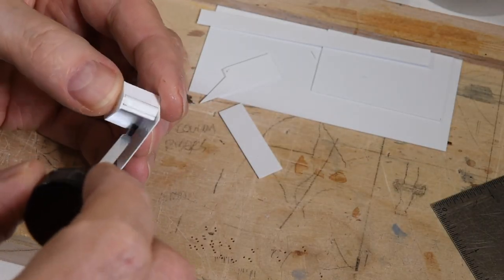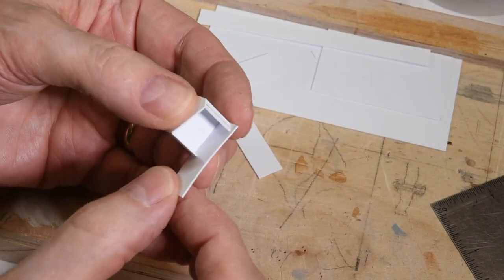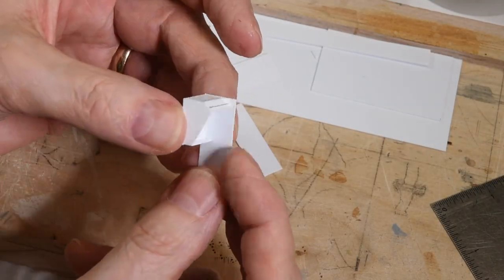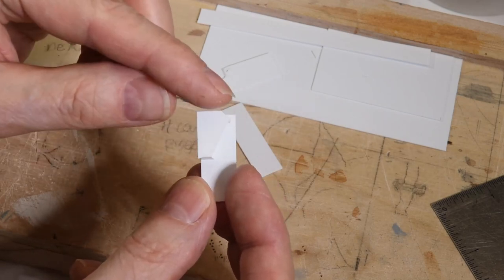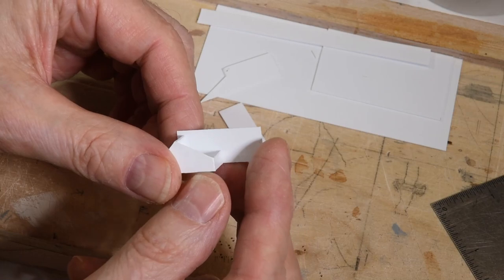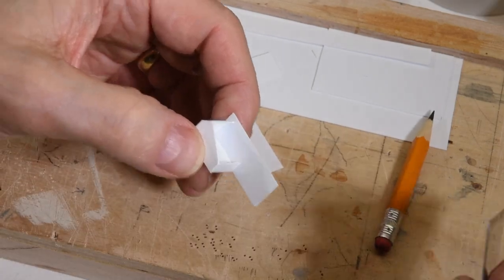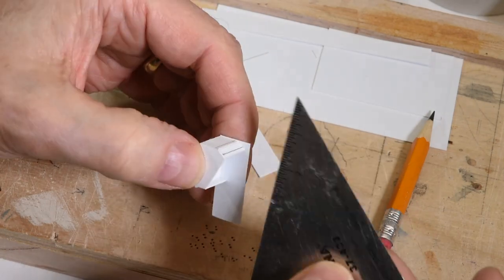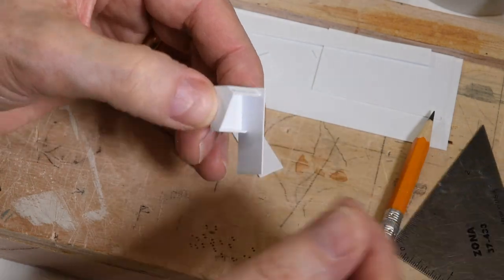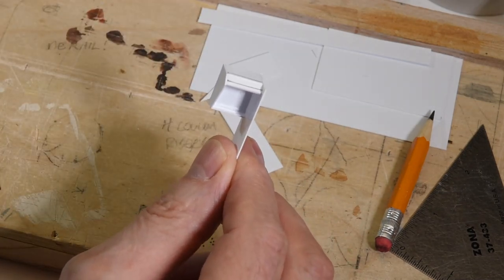It's just easier to build the side profile of it first, I find, when you're working from scrap and you don't know if material is totally square. But if you get the box square, like this back side and the bottom, and then you build off of that, it'll come out square for you. And then you can just cut this when it's dry, and then you can just take your knife and describe a line like that, and nibble off that piece, and you got your vent. Okay.